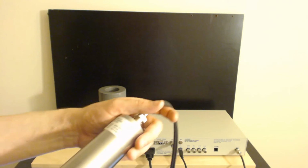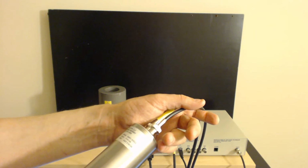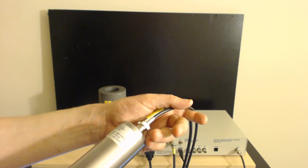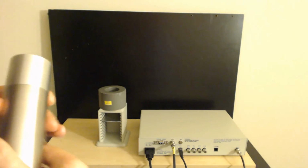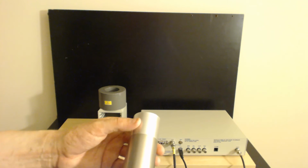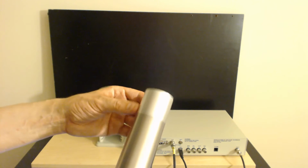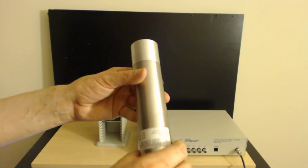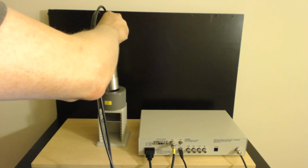This is a radiation sensors device. The model is 6S6P 1.5 VDC2. It's got a crazy model number. But anyway, it's rated at 625 volts positive to 800 volts positive, and it can go all the way up to 1,000. But after you go over 800, you're starting to eat a little bit into the life of the unit. So I wouldn't recommend constantly going over that amount if I could avoid it.